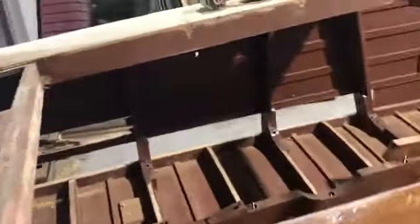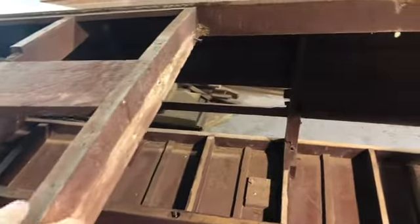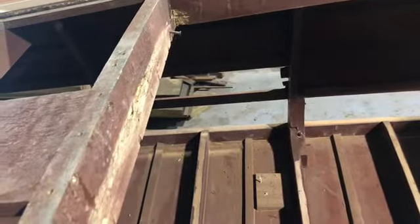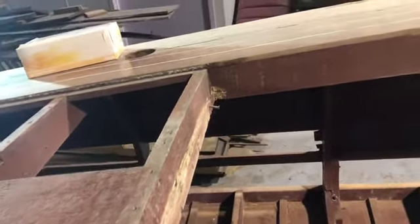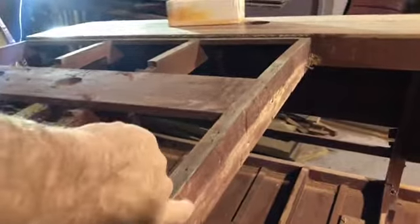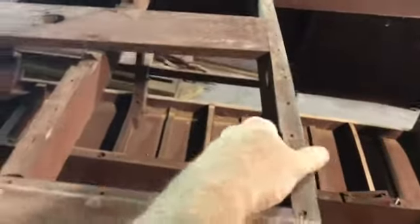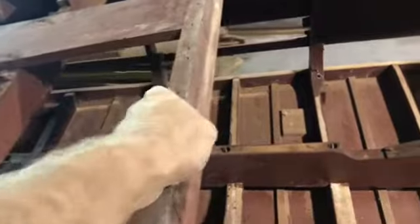Around the engine frame — it's always the place where water hangs. These boats sit stern down and this boat has got some localized timber rot through here and in this corner on the aft section that holds the engine hatch side trim. What we're going to do is cut a section out of here — about 50 to 60 percent up — sister on some stock, glue and clamp it, then put another piece of timber in there and dress it so it looks factory from the outside, but gets rid of that localized rot.